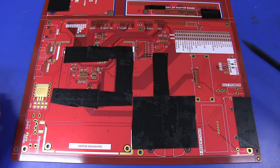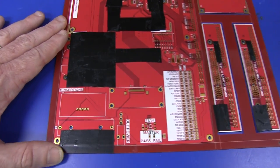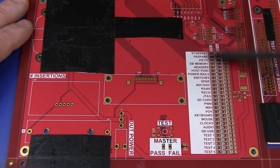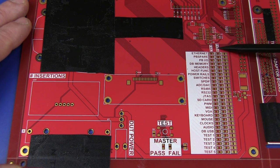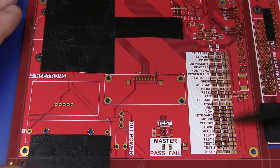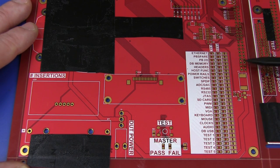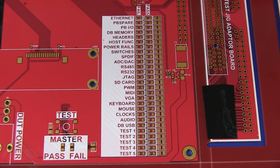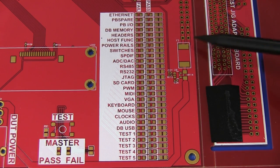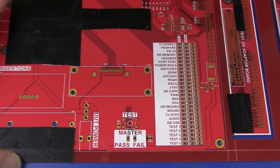It has various programming interfaces, power on/off powered from an external plug pack with its own local regulation. Most interestingly it has all the pass/fail functionality down at the bottom — all the different tests stepped through, some spares, with pass/fail LEDs for each one: red for fail, green for pass. It would just tick through each test and you'd see each LED come up red or green after pressing the test button. There's a switch to apply power to the device under test, and it can measure the board current — there's a polyswitch for overload protection, a current sense resistor, and a little current sense amplifier to measure current as part of the test.